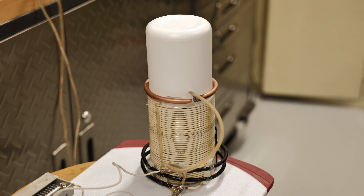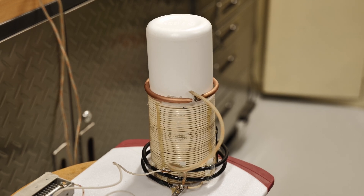Tuning a device like this with just an open coil is very difficult because stray capacitance completely detunes it from the frequency you're trying to work with. So this is the arrangement I came up with, and it seems to work pretty well.